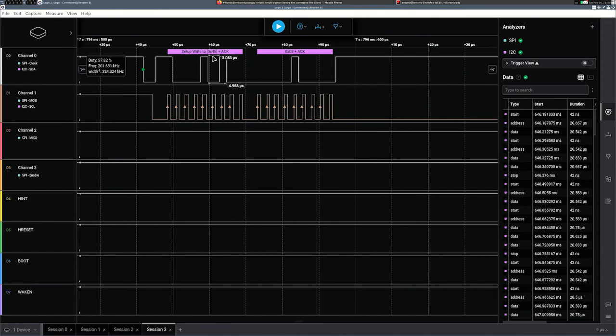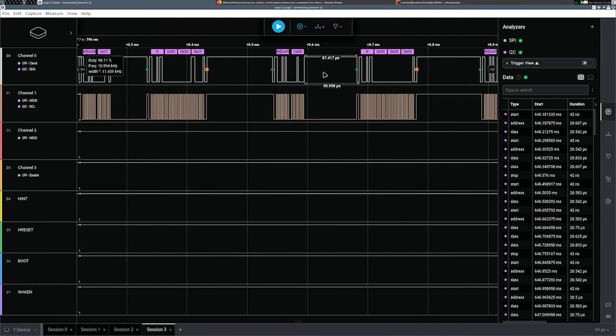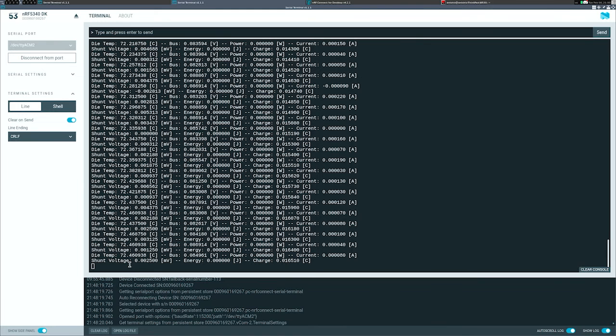Because all of the configuration and register values are taken from sysconfig, I haven't spent too much time reading the datasheet, but the values seem pretty accurate. Looking at the UART display, for every one second the temperature of the die is 72 degrees Celsius, the bus voltage is zero volts, and the power current is taking around 0.0003 — a very, very small amount. There is some small consumption somewhere, and the shunt voltage also has some value.